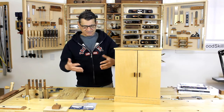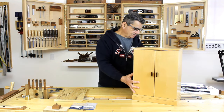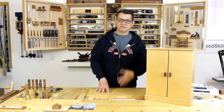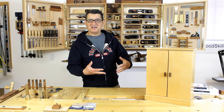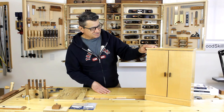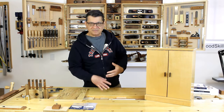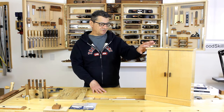That's why I've selected knife hinges exclusively in my work over the past 20 years. I've created countless cabinets on stand — I can't even remember how many. I'm also commission and spec-based and to this day create quite a few every year. I'm almost typecast as a cabinet on stand creator. I've perfected my installation techniques, and I typically have overlay doors just to simplify things — I like the fact that I can have a larger, expansive door. I have created cabinets with inset doors using L-hinges, maybe a half dozen or so over the years, but I much prefer the overlay style.